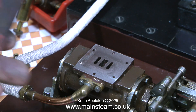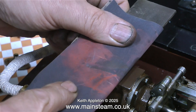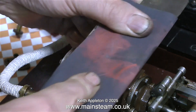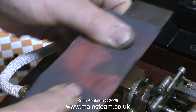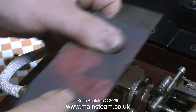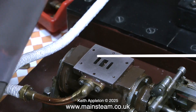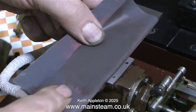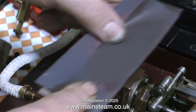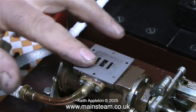Trying to avoid unnecessary work as usual, I didn't remove the cylinder to clean up the cylinder port face. Instead I used a piece of steel plate and some 400-grit wet-and-dry sandpaper. The port face wasn't very bad anyway, but you definitely need the sandpaper on a piece of flat plate like this. This job took quite a while — this is the edited version — and I also used some machine oil on the port face so that the sandpaper didn't clog. In the end I got a very smooth and very flat finish.